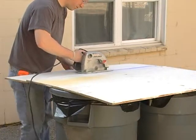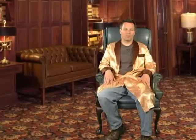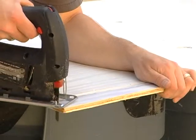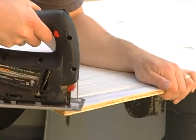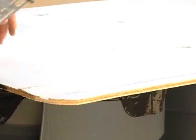You want to cut the plywood to whatever desired size and shape you would like your hovercraft to be. In this case, I made mine four foot by three foot — that was the size plywood I had to work with. Then you're going to want to round the edges so that later on when we put the tarp on to act as an air skirt, it won't get caught and ripped on the corners of the plywood.